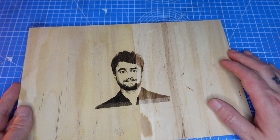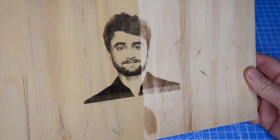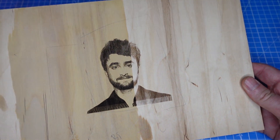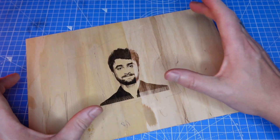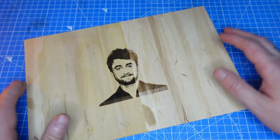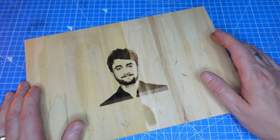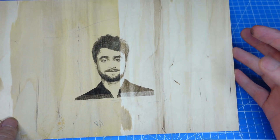This will look fantastic now as well for doing your lettering and stuff like that. All you would need to do is just put a quick clear coat over the top, and that would seal it in lovely. It'd work great with like name plaques and stuff. So if you had a nice wooden sign and you want dark lettering on it, you just paint the bicarbonate of soda mix on it, then just engrave it and seal it, and it'd look amazing.